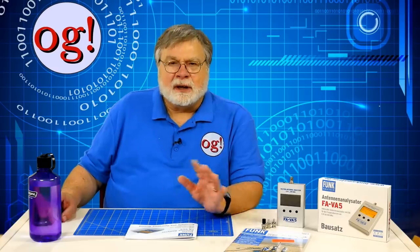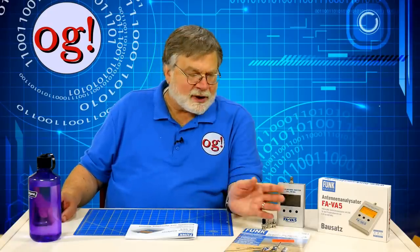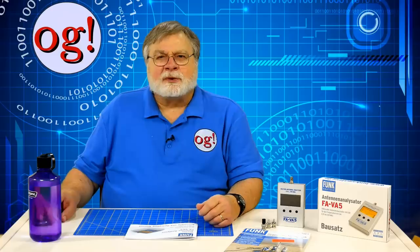You don't have to install a driver right away. Just attach the USB cable — which you'll have to supply — to the FAVA5 and the computer and it will install. But you need to go to the device manager to determine the COM port, in my case COM6. You must follow the instructions carefully and set up the analyzer per instructions for a firmware update using the menu settings. After unzipping the downloaded folder, I executed the BAT file.